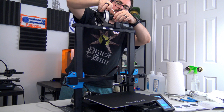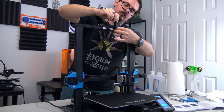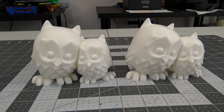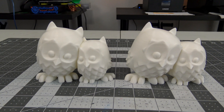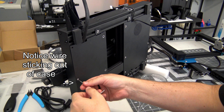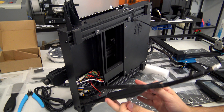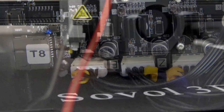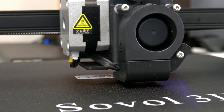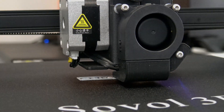I had a few small issues during my testing. Right after assembly, the filament runout sensor felt very stiff with more friction than expected, and I was concerned it might be causing the print defects on the Cuddly Owls. I even printed a second copy without using the sensor to test, but it turned out not to cause any print differences. After just a few hours of printing, the filament sensor became much smoother — it just had to be worn in. When I was checking the mainboard, I noticed that the wires for the fan were crushed against the frame from the factory. My fan still worked, but if the wire had been damaged a little more, it would prevent the fan from cooling the stepper drivers. The only other issue is the rough-sounding print cooling fan — the rest of the machine is so quiet that it draws attention to itself when it kicks in.